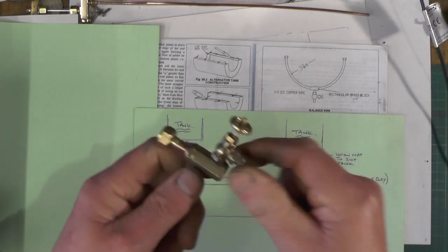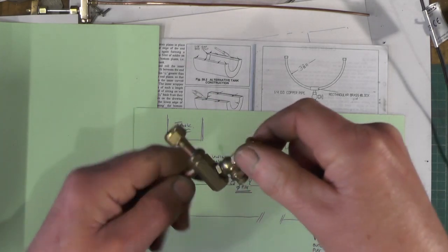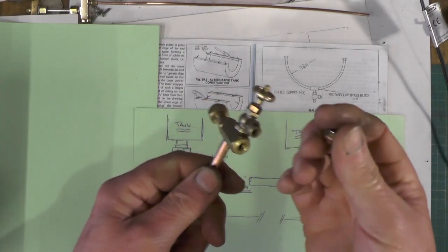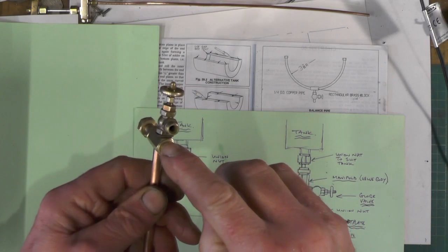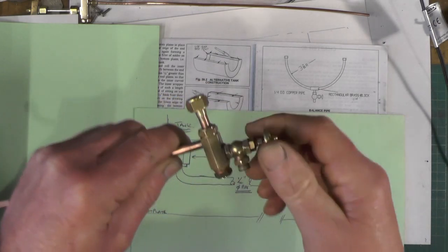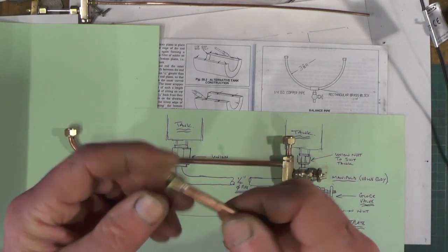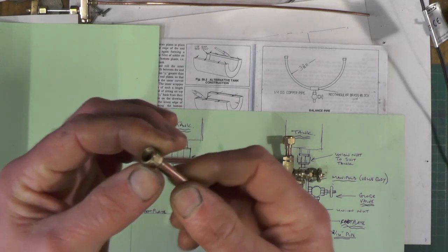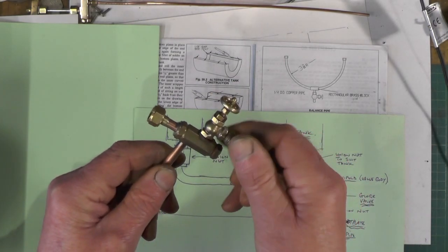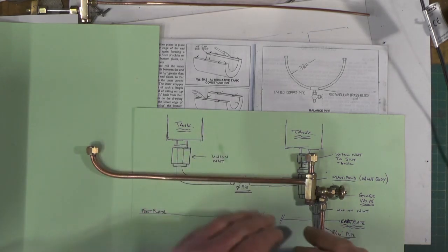All that's fixed and rigid now. On the other side, just below the pipe, I've drilled and tapped it to accept my globe valve, which in my case is 5/16 by 40 thread. I've put a blanking plug at the bottom - you don't have to do that, you could just take the valve off to clean it out if it ever needs it. I've also made this little outlet adapter - it's just a small union nut soldered onto a piece of pipe - and that's going to screw onto my valve and come through the footplate so the water just drops down past the sides of the wheels.